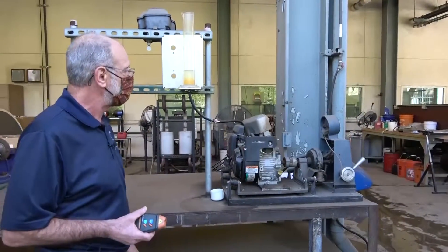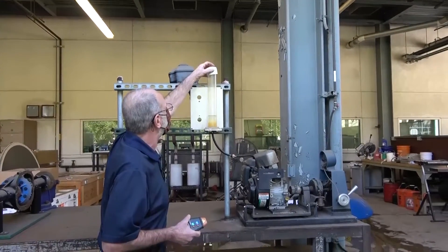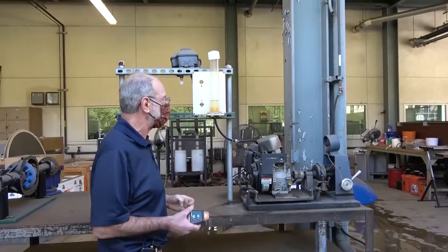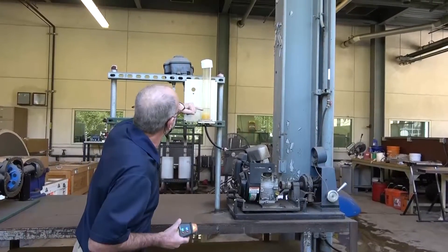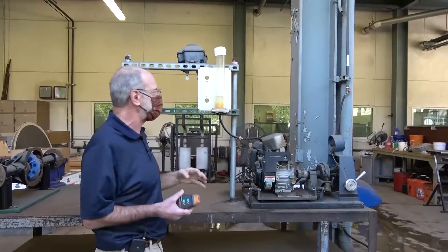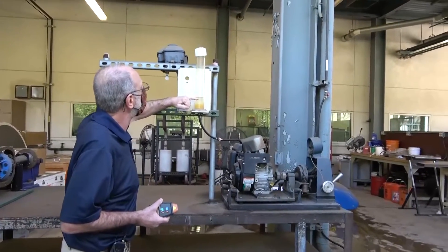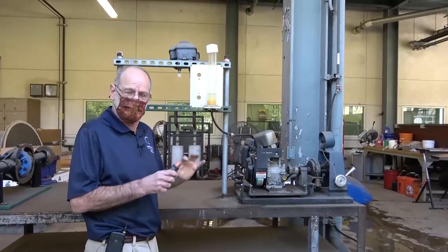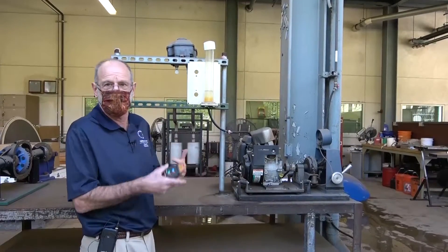We'll make sure we turn on the electric supply by putting that switch on. The fuel is measured here — this is old-fashioned, but electronic fuel flow meters of the low-flow variety are incredibly expensive, hundreds of thousands of dollars. This is just a plastic cylinder that costs two bucks. We'll measure the fuel flow rate manually — just see how long it takes for 10 milliliters, or 10 cc's, of fuel to flow into the engine. Divide one into the other and there's your volumetric flow rate. You'll also need to use a hydrometer to get the fuel density in order to convert from volumetric to mass flow rate.